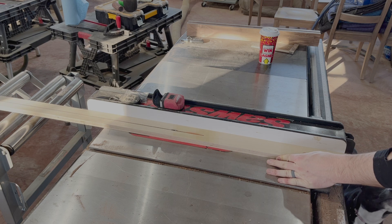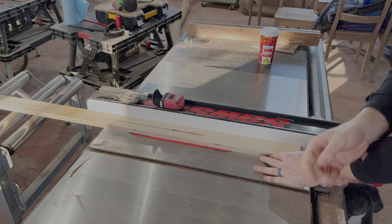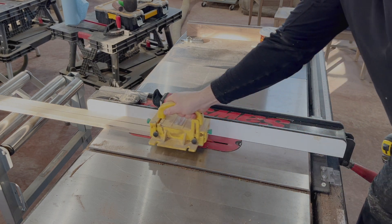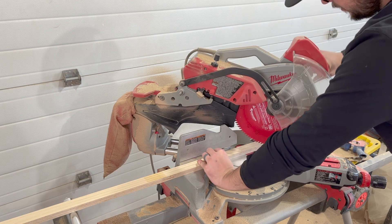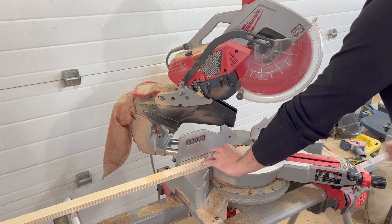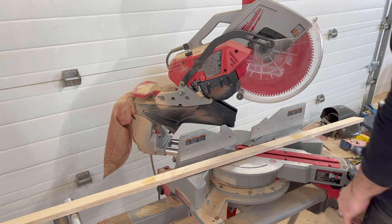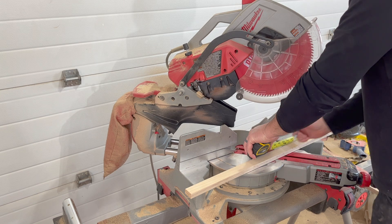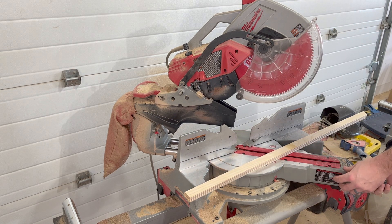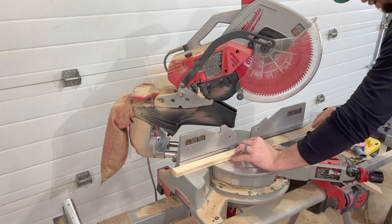Once my plan was made on SketchUp, I was then able to cut some pieces of plywood out to match what was in my drawing. I did this to ensure that the miters were going to line up, and I can use them as a template to mark my steel. This guarantees that all the pieces will be the same for both sides of the chair, which is an important step when fabricating anything. The strips of plywood that I cut are 1.25 inches wide, which is the same dimension of the steel tubing I'm going to use to construct the chair.